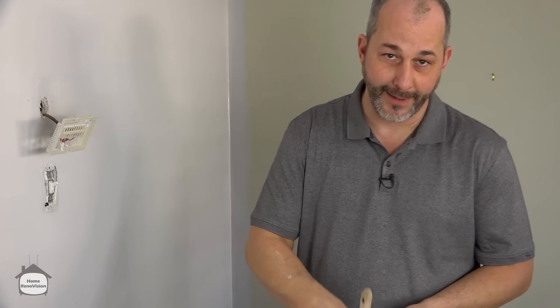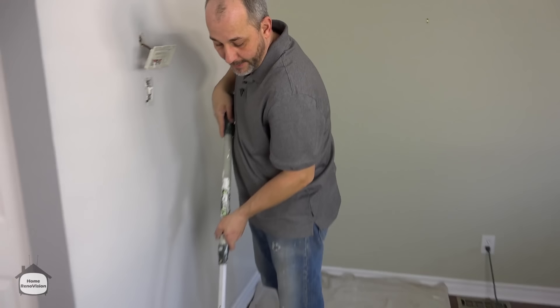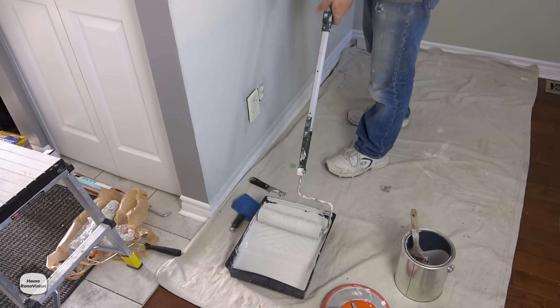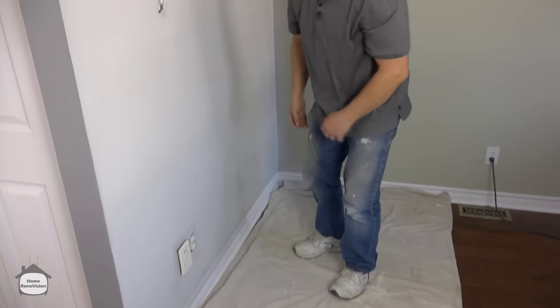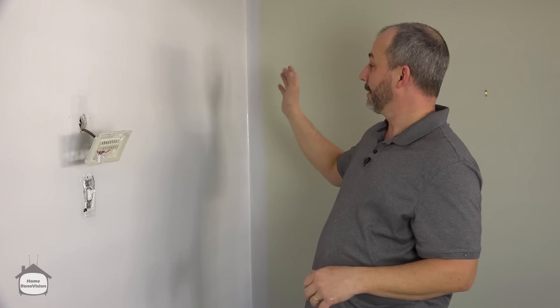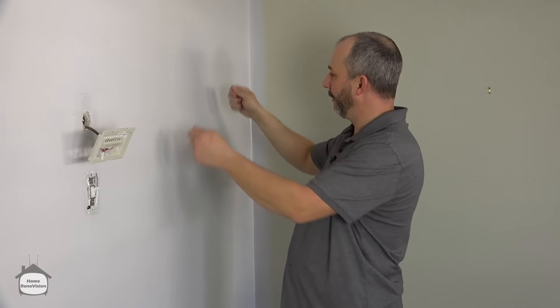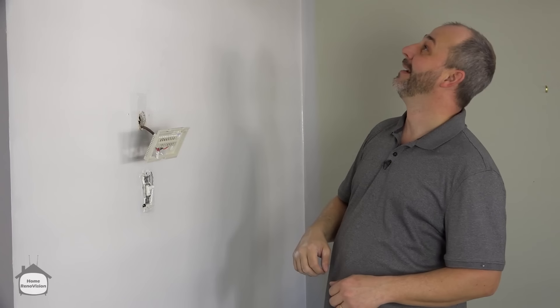For the purpose of this video we're just doing a demonstration — the homeowner is watching and learning. We're going to go for a coffee break now. When taking a break, load your brush up and set it in your can. Same with the roller — load it up and fill it full of moisture and you'll be okay. Come back in about 20 minutes. The paint will be dry enough to do the sanding and second coat — it's 100% acrylic paint, these things dry really fast. There's just a little dark spot where we filled the holes with the 45-minute mud, but after this coat is dry that'll be the end of the flashing. We didn't have to prime — this is a super fast way to paint your house.